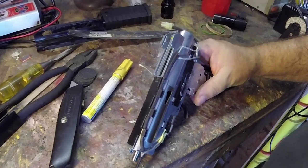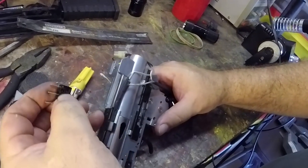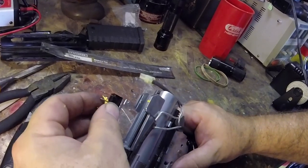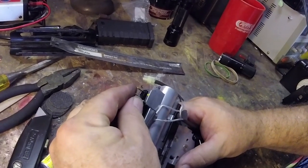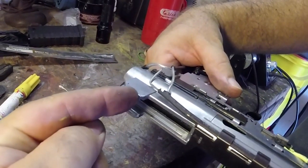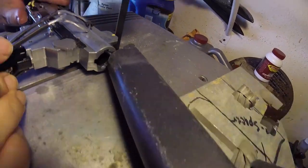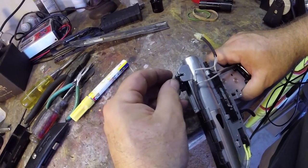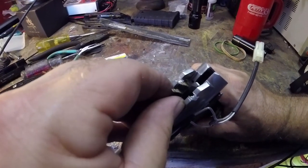It's time for probably the biggest high-risk operation here. We want to cut a slot at the yellow marking for mounting our micro switch. We'll use a screw just small enough to go through and run to a nut on the other side. Rather than drill a fixed hole, we need adjustability, so we're cutting a slot that lets us maneuver the switch to hit the right point — tuning it to get just a single count per move of the gearbox. We'll lay this on the bandsaw, cut in and hollow it out, using a vacuum so we don't get metal particles into the gearbox. We've got our slots in, a little adjustability, and we need to design shims to cover the width so it doesn't flop side to side. By and large, the problem is solved.